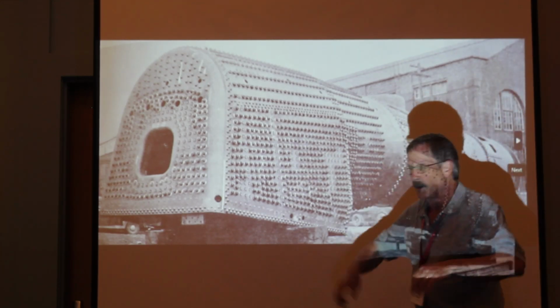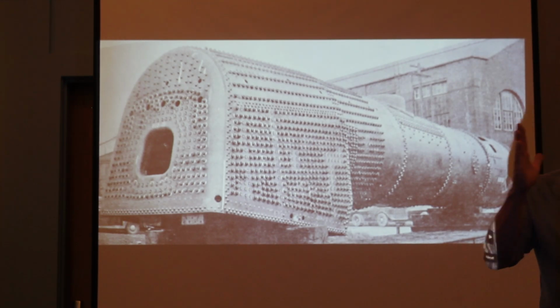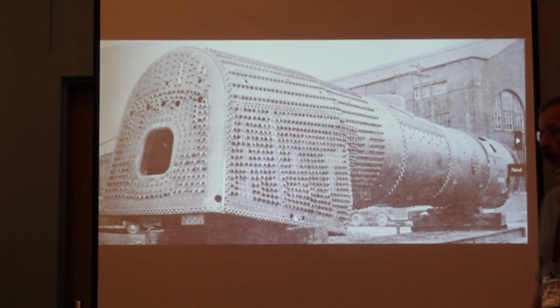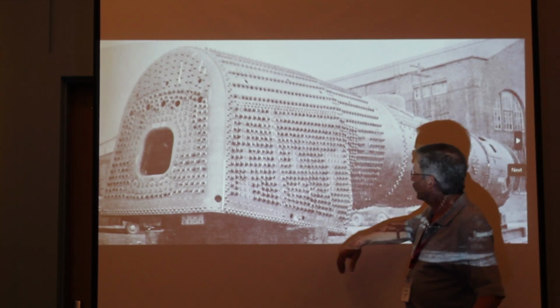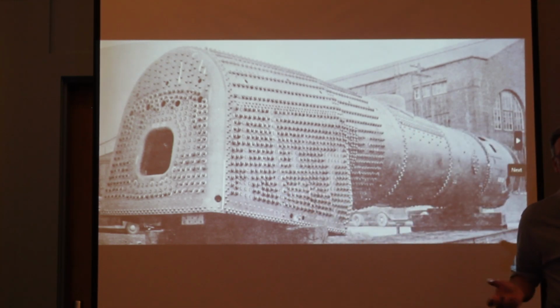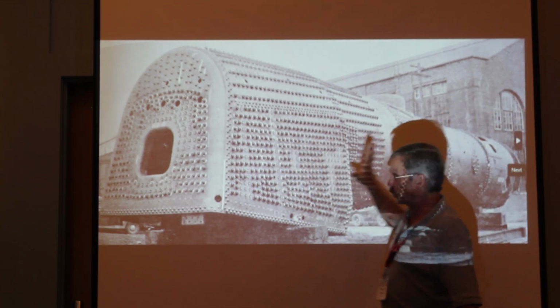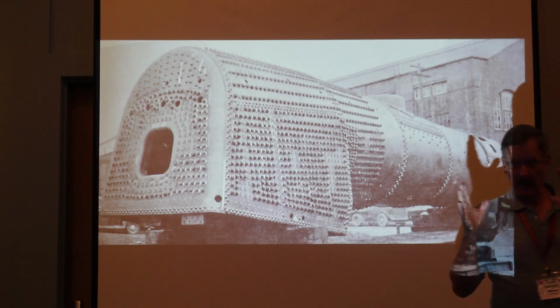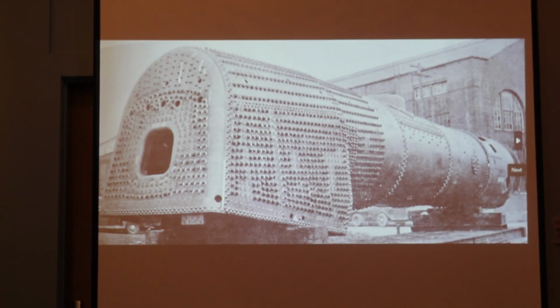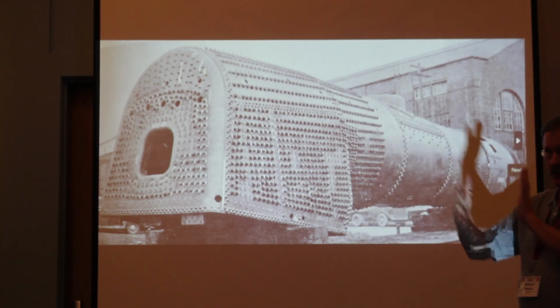What happens is, water's in there, you make steam, and the steam pressure builds up, trying to collapse the firebox. It's trying to crush the firebox. And what stay bolts do, and again, roughly averages, every 4 inches horizontally and vertically, generally speaking, is the pitch, center to center, of one stay bolt to the next. And that's a calculation. Because the steam pressure is trying to push the shell out and crush the firebox, you want to keep them where they're supposed to be. So the stay bolts, as the name implies, stay the shell to the firebox.